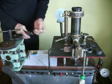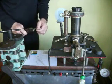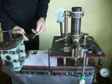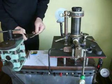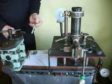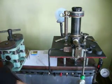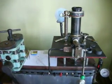The quality of the metal and precision of the spin casting into graphite is light years away from the problems that result from traditional methods. No wax or plaster means no shrinkage, and spinning at up to 20,000 RPMs results in an unusually dense metal, making it highly suitable for fabrication or enamel.